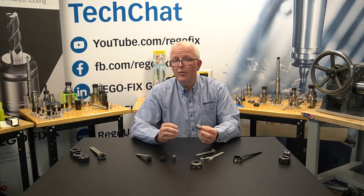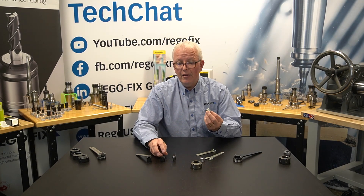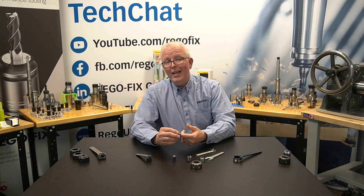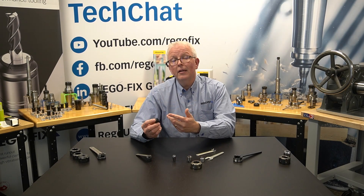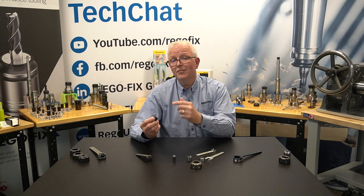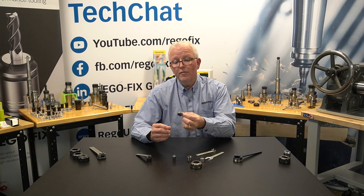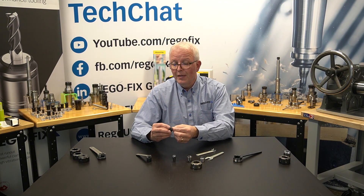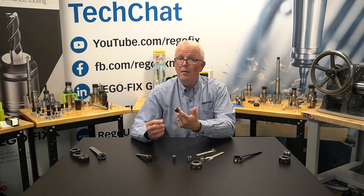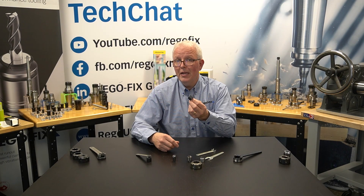The original mini nut uses a crow's foot or wrench that goes over the top to lock in and tighten. Just like we went through and improved the UM nut, we did the same thing with the mini nut. We took the Hi-Q process — the special heat treat process — and applied it to the mini nut. We also improved the balancing on the inside when we redesigned the eccentric groove. That means this nut is more suitable for higher speed applications, and you get those higher clamping forces because of the Hi-Q treatment.